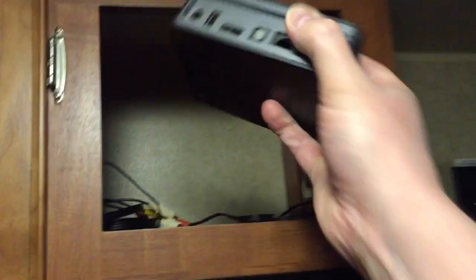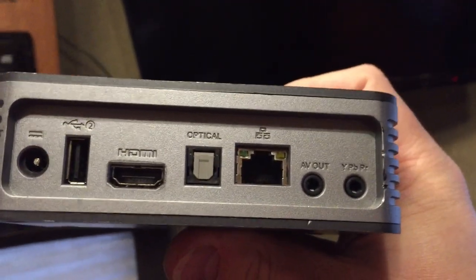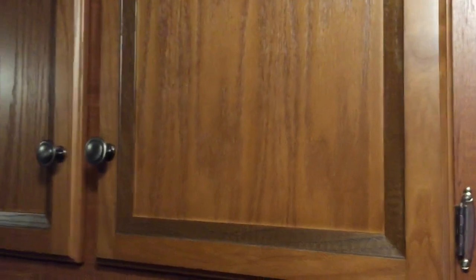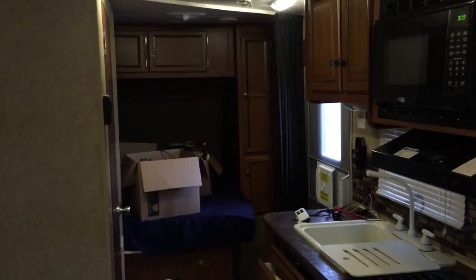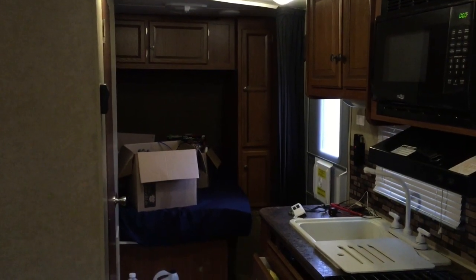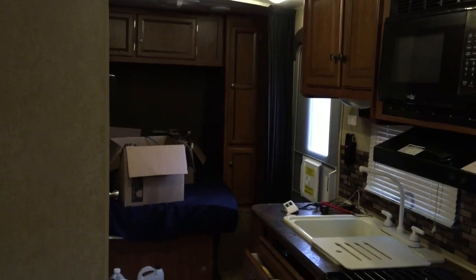You'd have to buy one that converts Dolby Digital, which requires a copyright license. I'm not sure who makes those other than giant AV home receivers, which would be way out of scope for what we're doing here. The nicer the TV, the more likely you are to have your Dolby output switchable on or off to PCM. You can also connect the digital output to other things - this old Western Digital box has regular AV out and optical and you could technically connect that into a converter box as well. From the musty dusty winterized RV, I'll see you next time, probably next week, and we still haven't done the tour so that'll probably be next week's video after a little spring cleaning.